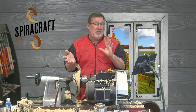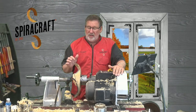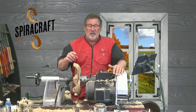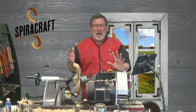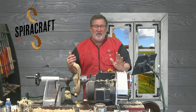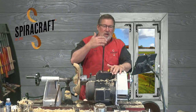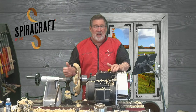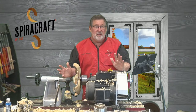All right, now the flip side of that, and it's real, is that the faster it's going, when one of these legs breaks, like where I have the split right here, if that broke, that piece is going to be a serious projectile when it comes off. So there's a balance in there of how fast you're willing to turn it to get what quality of cut, and a trade-off for your safety with the safety gear that you're wearing, because the last thing we want to do is get hurt. You can always sand it if you have to.